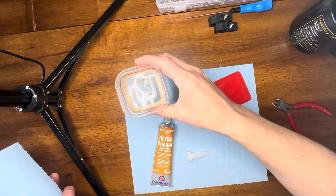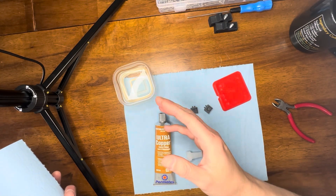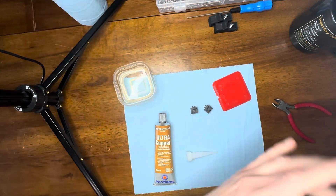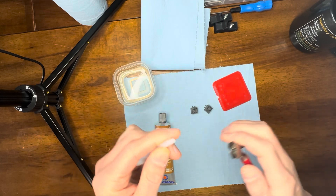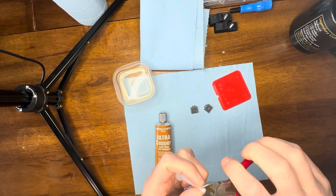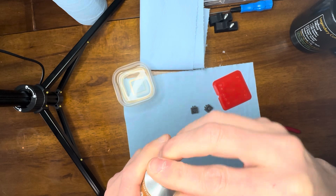All right, we're back. I got myself a little bit of water here. Silicone is hydrophobic, so as long as you keep your hands wet at all times it won't stick to you. Soapy water with a little bit of soap will be even better — I'm just using regular water. I also like these blue shop towels; they're nice and thick for cleaning up your hands afterwards. The first thing you're going to want to do is cut your nozzle — you want a pretty precise, small hole. You don't have to worry about a 45-degree angle like you're doing caulking, because you're filling a cup. The second part is you need to open your RTV tube — there's just a little pokey thing in the cap, you put it in backwards, push it through and you're open.